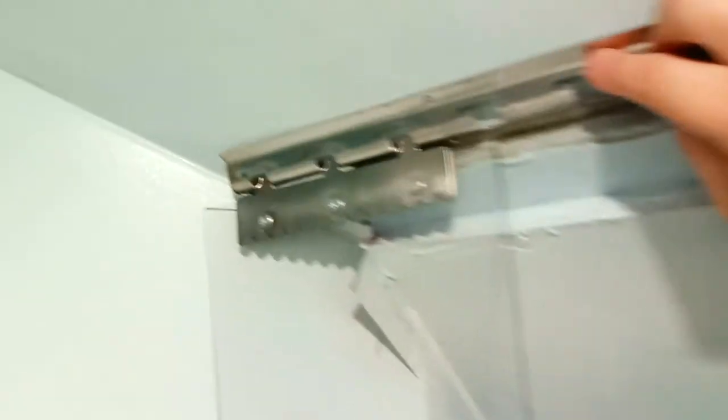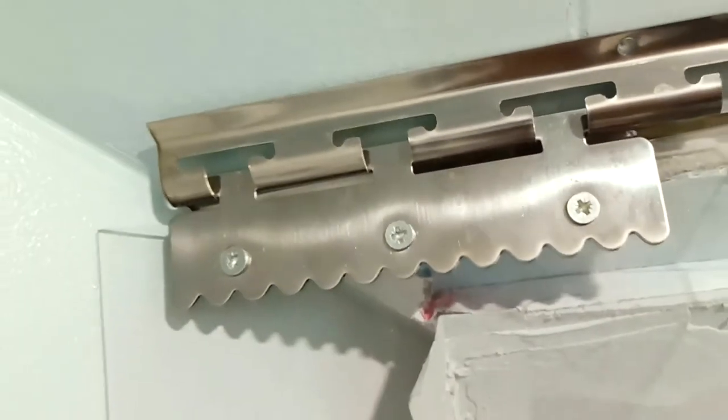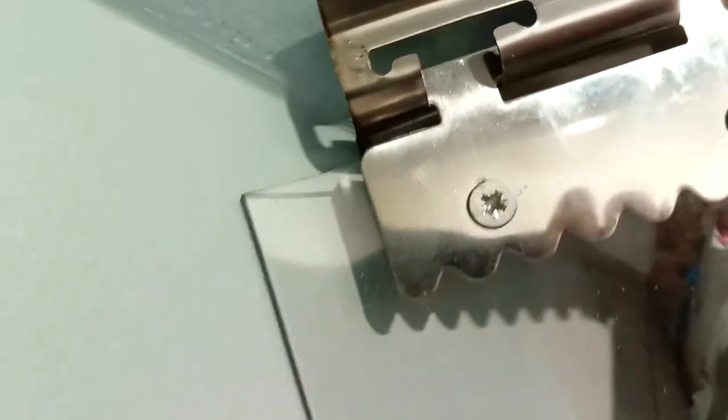You can use these for garage rooms or absolutely anywhere. The first step to install is to hang one of the flaps on the very edge — that's going to show you how far from the edge to start. You can see there's a little overlap to the edge of the wall, so make your mark with the screw right there, take it out, and screw it in. Hopefully there is a stud over here.